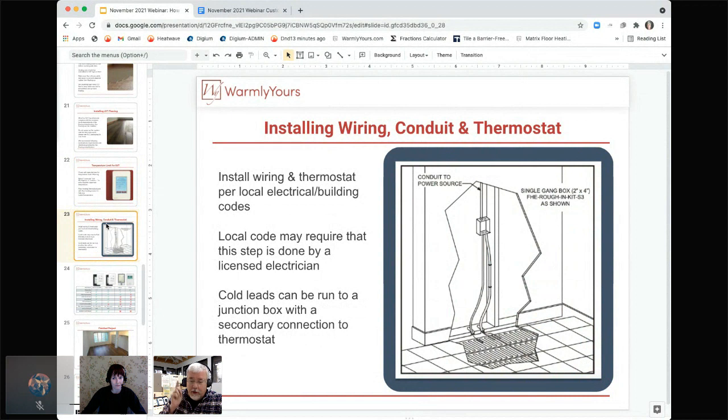People ask every day: can I put the floor sensor wire in the same conduit as the non-heating leads? The answer is no. You need two separate conduits going to the floor — one for the sensor and one for the non-heating leads. Some local code doesn't require a low-voltage sensor wire to go in conduit, but in Chicago they do. Just run the sensor wire down the open wall gap and out to the floor. Never run the sensor wire and the high-voltage lead for long distances right next to each other, because induction from the high-voltage lead will blow out the readings from the sensor and it will never act correctly.